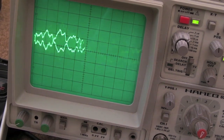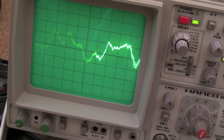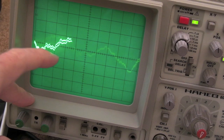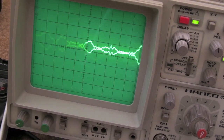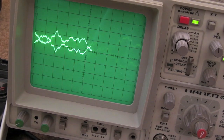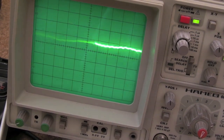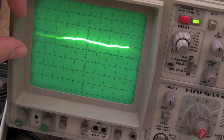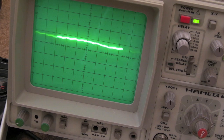The one thing I would say — I've had some fun playing with this scope, actually. It's been worth this investigation just to mess around with my scope to work out some of the settings I never knew existed on it. For example, you can see that's kind of like a differential mode — I've got one probe on the positive, one on the negative, and you can see the difference, despite the fact that the grounds are identical for both. If I invert channel 2, you can see you've kind of got a mirror effect between them — that's quite nice. It's on chop mode at the moment; if I switch chop off it's very different. If I invert channel 2 and put it on add, you get that interesting line there — I think if it's inverted they cancel each other out, and that's the addition of the remainder. That's between one side of the cap and the other side of the cap, with different coupling going on. I've got both set to AC at the moment just to remove the bias.